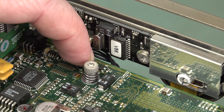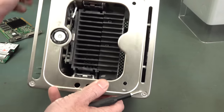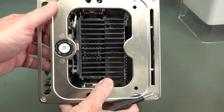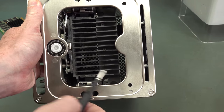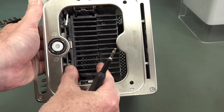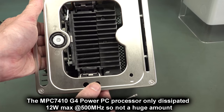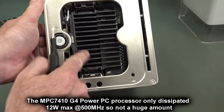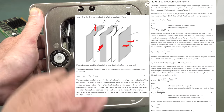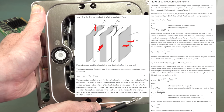Secret button - I wonder what that does. And you can see where the secret sauce for the thermals is - you can see right through there. So passive heatsink - of course they've got the fins in the right direction. If they didn't, you wouldn't get your passive convection flow going right up. You need really deep fins on your heatsink to get the massive surface area required, and you can't have them too close together because that interferes. There's lots of complex thermal modeling involved in heatsinks if you really want to get down to it.